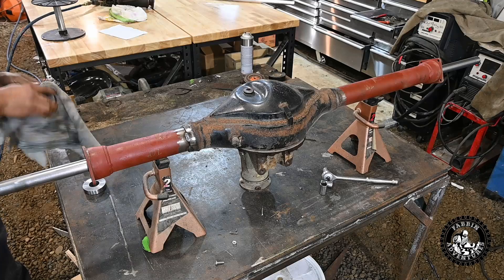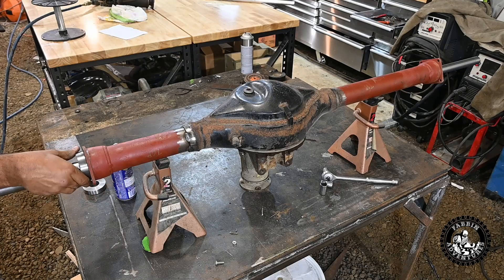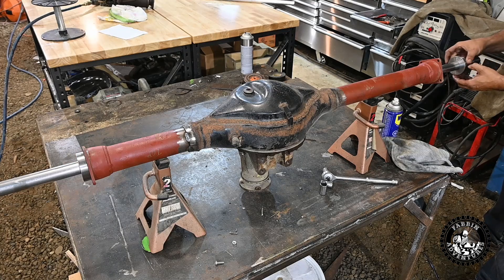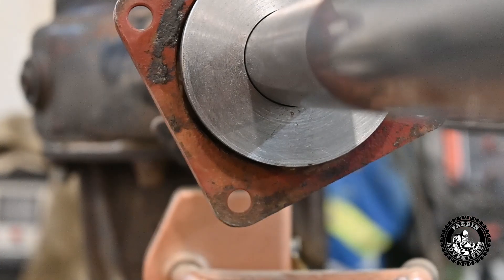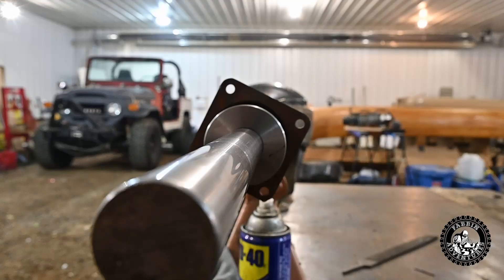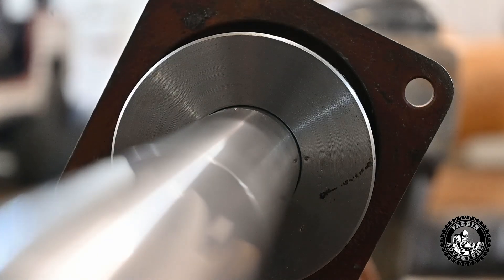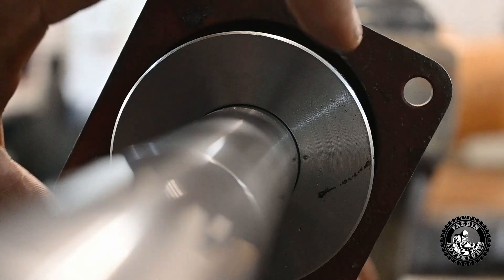Clean these up real good, give them a little shot of WD-40. Darn close — and that one's out. So there you can see how much it's out. It's not even an eighth of an inch on this side. And we'll go check the other side. This side here is for sure an eighth inch — it's probably more like three sixteenths of an inch out. So we're going to have to cut a couple of those welds and bring this down to where we can slide this puck in.